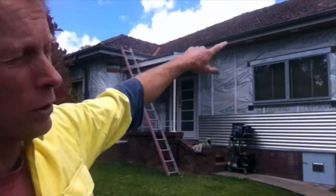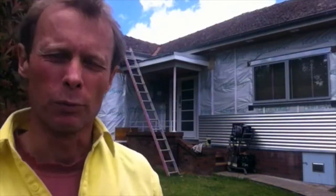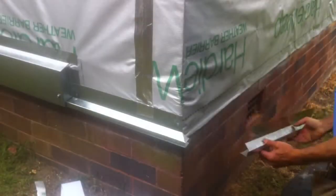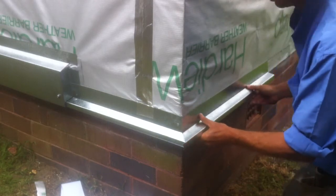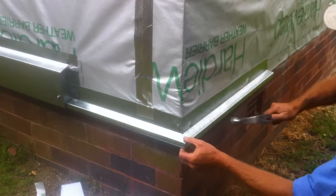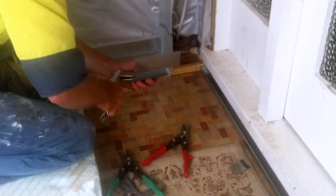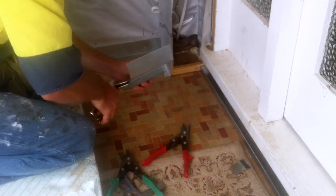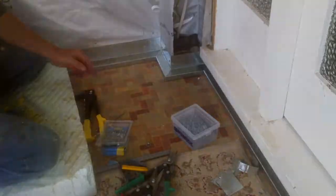So top and bottom of the walls, around the windows, around all of the details — we put these metal flashings in place, and then the cladding goes on over the top of that. Here I'm installing some of the flashing that goes around the base of the wall. And when we get around to that front porch area, you'll see that the flashing details get a fair bit trickier. We have to go around various obstacles and it takes a fair bit of time to get everything just right.